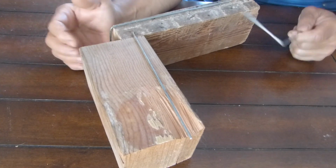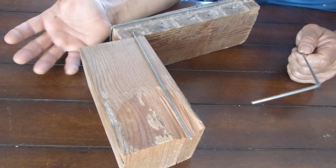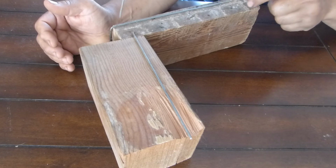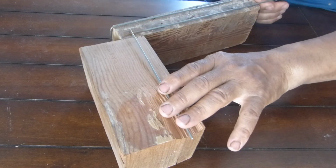And there's temperature steel at the very top, but that's the top steel in the deflective zone, the tributary area, where it would be better to have the stronger steel at the bottom, the more rigid steel at the bottom and not at the top. But I want you to see this interlock here. So here's your number 4.